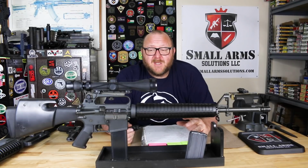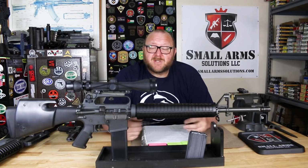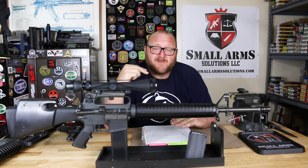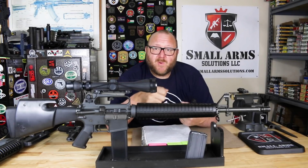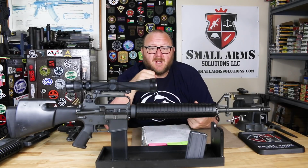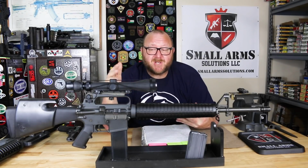And what I mean by quality is, as far as a commercial sale, you have to understand there's different standards for commercial and military. Military, if the upper receiver meets a color palette, it's good to go. The lower receiver meets the color palette, it's good to go. They don't have to match. There is a certain amount of wiggle that's allowed. There's a gauge that tests how much wiggle the receivers can have. The parts are all interchangeable. The military rifles are looser, and the quality control on the finishes matching is different.